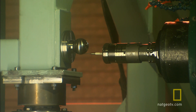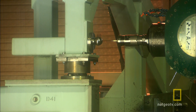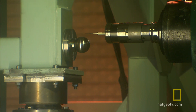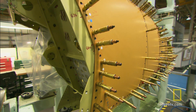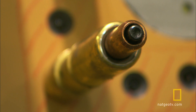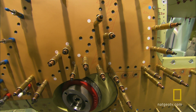Just like the wings in Italy and Spain, the placement of the drill holes is crucial. This part must also connect to other parts made hundreds of kilometres away. If the holes don't line up, this aircraft will be grounded. Holes are bored for temporary fasteners. These will hold the skins in place until permanently fixed.